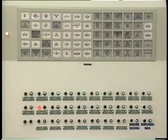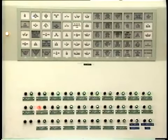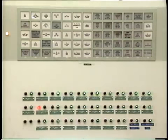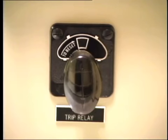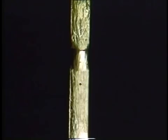Now, there are a number of different operating conditions that can lead to the dramatic failures that we have just mentioned. So the boiler must be equipped with first an alarm system to warn the operator of impending dangerous conditions, and secondly, protective devices that will automatically take preventive action. One of the most obvious potential hazards is that of water level control.